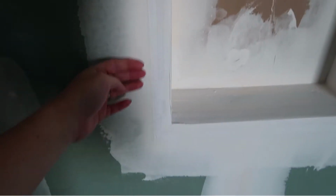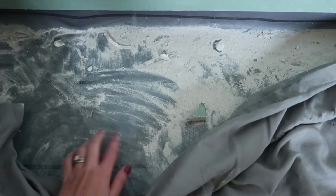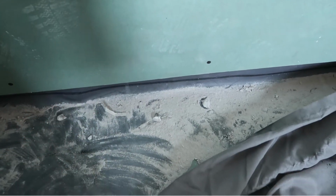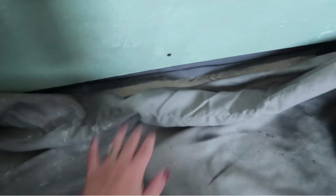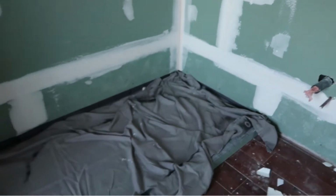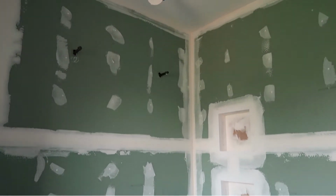I'm going to do the whole shower. So the water would just run down, and then, if you guys can see this, this is a rubber shower pan, and the tile will go on top of that. So it basically goes from the rubber membrane and runs right down into this rubber pan and out into the drain. So it's just some extra protection for your drywall. One extra step, but in the long run, it'll make a big difference in how long everything holds up and lasts.